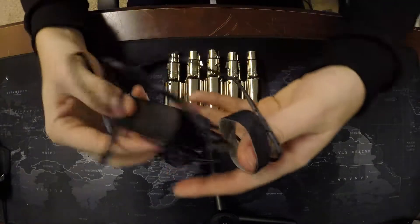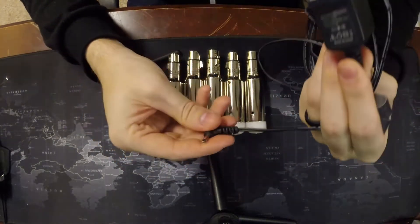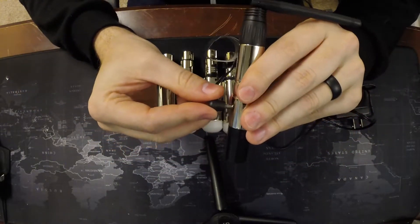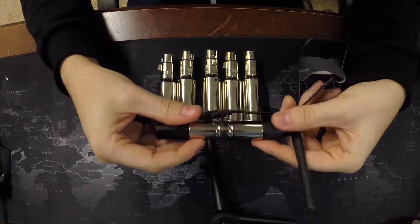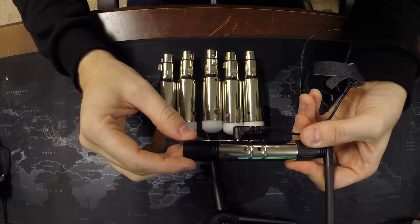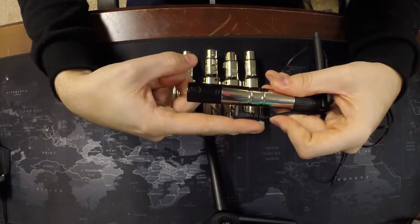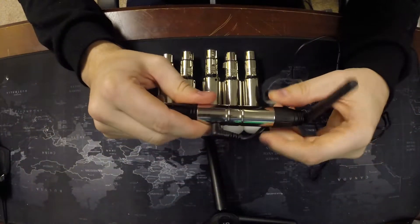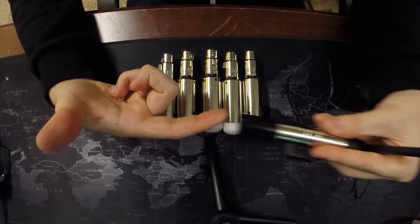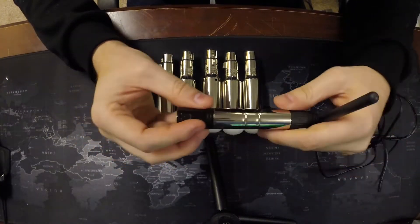The transmitter's power cord is a standard wall wart — five volt, one amp — with a standard wall plug on one side and a very tiny plug on the other that goes into the transmitter's side. One downside is that if you have multiple DMX outputs on a console that are close together, the way the transmitter is oriented could get in the way. You could always put a small XLR pigtail on it to get it away from the console. For me it's not an issue since this plugs into my ArtNet node, which has outputs spaced wide apart.